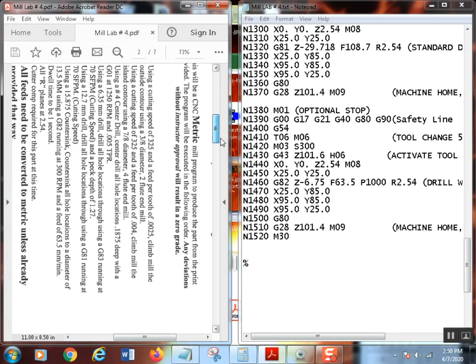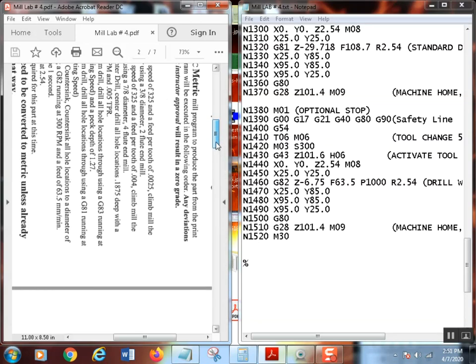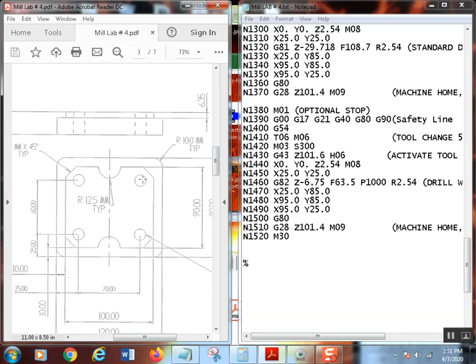To a diameter of 13.5 millimeters. That's what I wanted to put on that. I'm sorry, I have to read that sideways. You have to trust me. So these are 12.7, plus or minus a couple thousandths of an inch, depending on how properly the drill was ground. Anyway, we're on to 13.5.